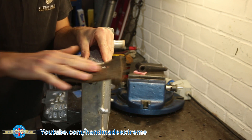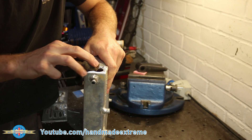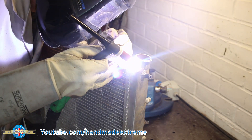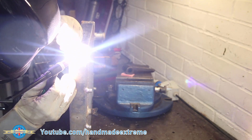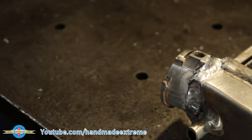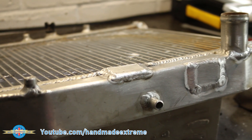There's a bit more involved in welding aluminium than there is steel, but the first thing you've got to do is make sure you get all of the oxide layer off. For doing that I use some really coarse brown Scotch-Brite — it seems to make really light work of it. A couple of small tacks to hold things in place while precariously balancing the radiator on the workbench, then weld the bits on. Here's the repositioned filler neck, two little patches to blank off the holes, and the relocated inlet pipe.